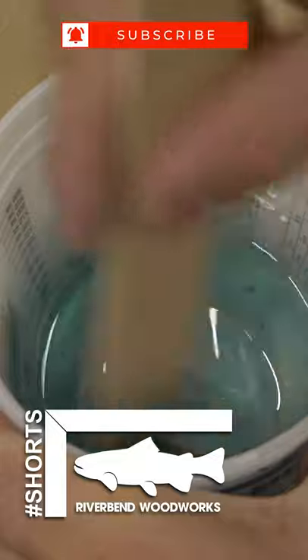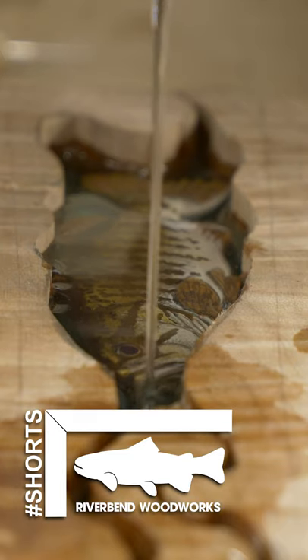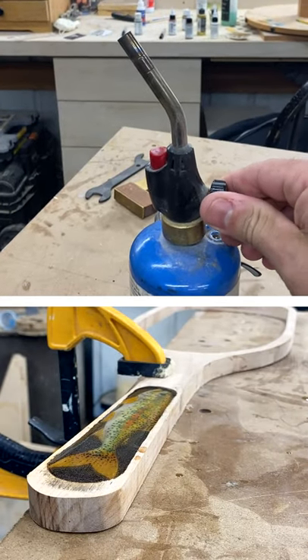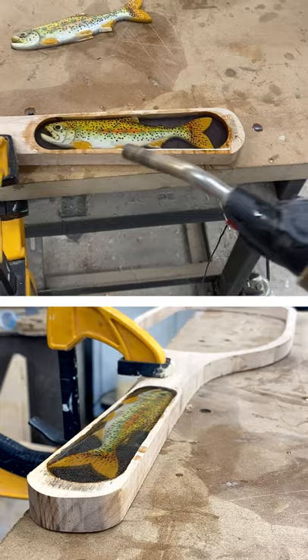It really is crystal clear. You can also add pigments to it, like the black diamond pigments that I got with my TotalBoat stuff — it really does a good job. You've got to mix them in thoroughly. You will get little micro bubbles, but at room temperature they just rise to the surface slowly, and you can use heat to help with that too.